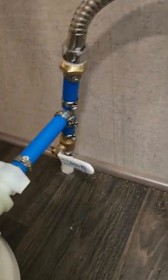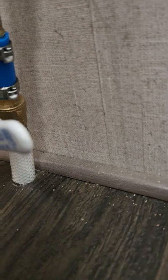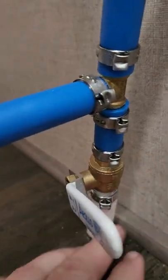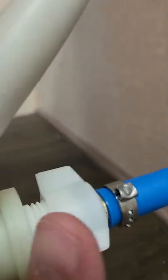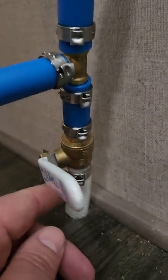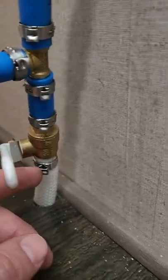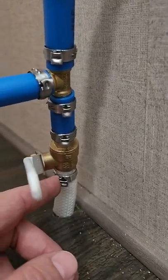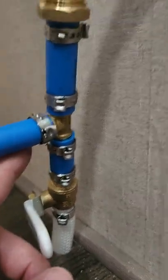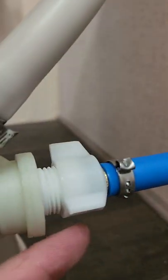It's really tough to get good connections with that, so what I ended up having to do is I cut that off at the floor. This is the one that came up and around into the toilet initially. I cut it off at the floor, put a clamp on it, then put a ball valve in, and then came up and over to the toilet.